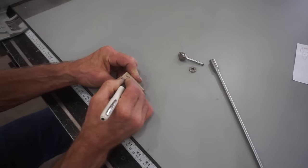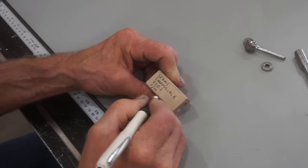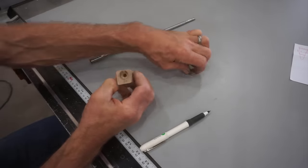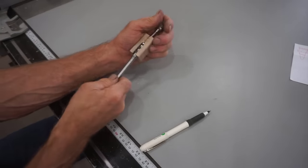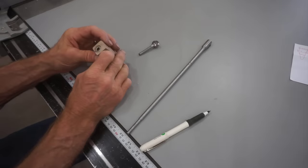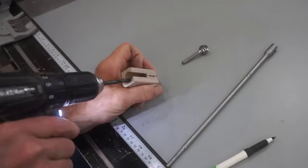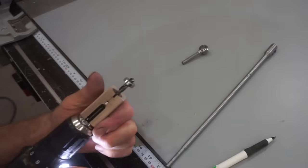And there it is — Seams Impossible version 1.0, serial number 0002. Now I just push a bearing into each end of the block until it hits that small dividing web, push the burr shaft in from the short end, slip the extension over the shank from the other end, and tighten the set screws. If you have alignment issues, just carefully run a quarter inch drill bit through the center holes of the two bearings to get everything to line up hunky dory. That's yet another argument for the value of CNC machining over a drill press in a cabinet shop.